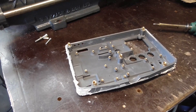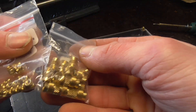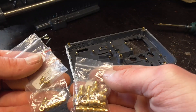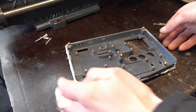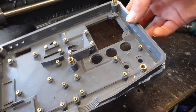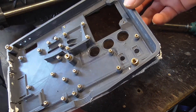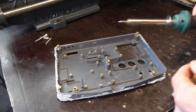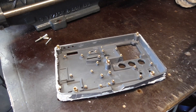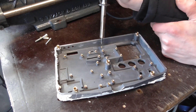After applying two layers of putty, I will install the threaded inserts, as I will need these to line up the two holes for sanding. These inserts are pretty useful — this is the first time I use them, and I am sure I will use them in future projects as well. It is important to print a correct diameter hole, and then I just apply the heat with a soldering iron to let them sink in place, making sure to keep them straight.